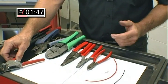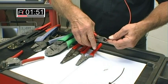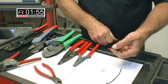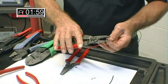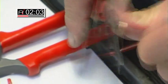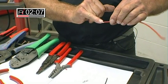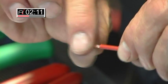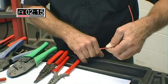The cable can be stripped or terminated in several ways. Use side cutters for a nice, clean square edge. You can also use the traditional pliers for stripping back the insulator. And be very careful that you don't damage any of the strands of the cable — that's something that really needs to be stressed. There should be no damage at all to the cable.